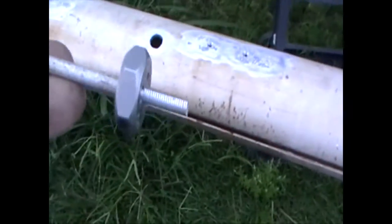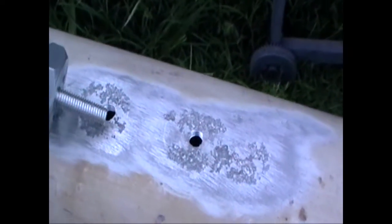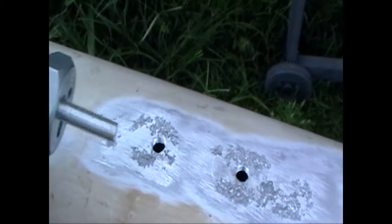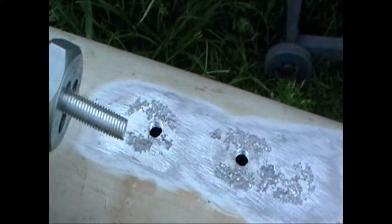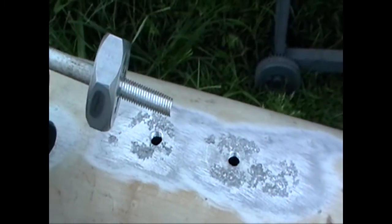The intent is I plan on dipping the end of this into the epoxy, rotating it four times so it protrudes down in there just a little ways. This will actually thread in — tap in four times — then hacksaw it off. The reason the die is on there is that when I hacksaw it off, I'm going to damage the threads on the end. So I'm going to unscrew the die to clean the threads and then put it right back. I'll continue in just a moment — I need to put the camera on a tripod.